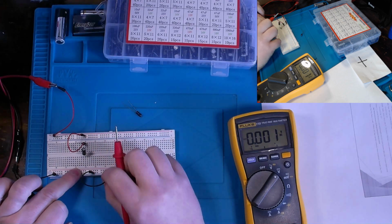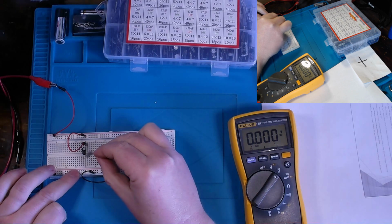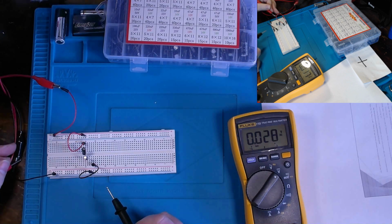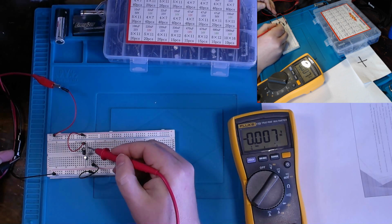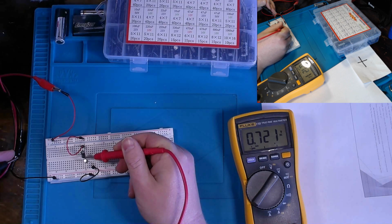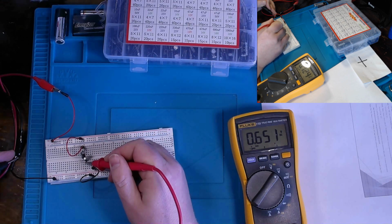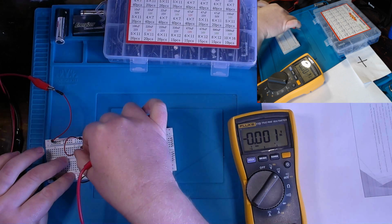Now, if I was to remove this lead out, and let's put our 22 microfarad capacitor back in series with our 100 microfarad capacitor, and we put our circuit back together. Now I want to show you something. I've got my leads backwards, but we still got 5 volts going to the first capacitor, but look, coming out that second leg. Because we've charged it a bit, we're showing almost a full drop in voltage there. Almost 5 volts drop, but 0.7 volts coming out to the second capacitor, and then at the output of that is 0.